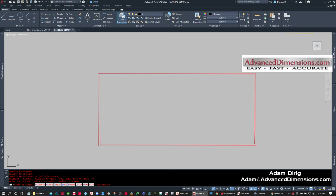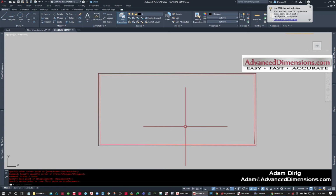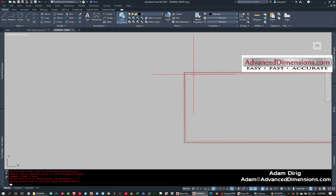35. I could do a rectangle that is 71.25 by 35, and then I would say, okay, yeah, that's what my measurements were with a tape measure, but when I go to install it, look, I'm pinching right up here because this is out of square.